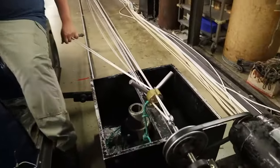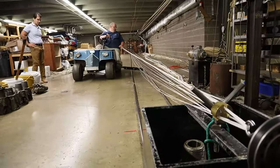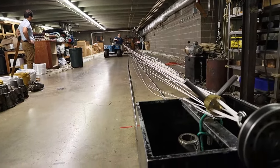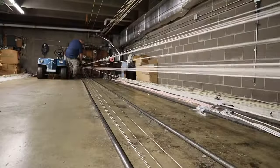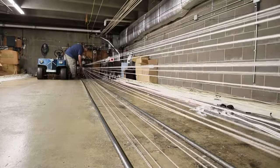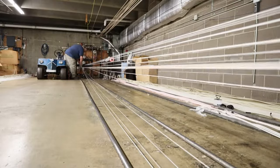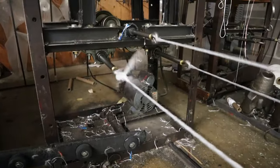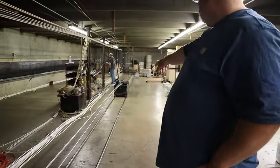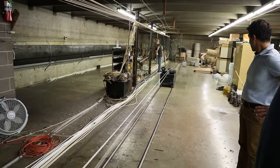So I'll double this thread over. I've got seven — I'll double it until there's 14 in each one. And I've got to go back to the other end. Start spinning those threads into their individual strands. Once I get to that black tape mark on the floor, I'll turn that back burner on, and I'll spin all three of them into one rope.